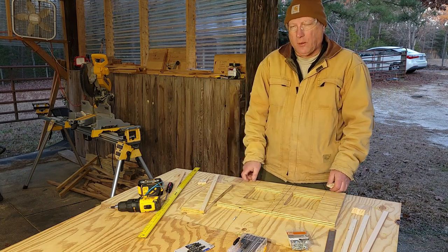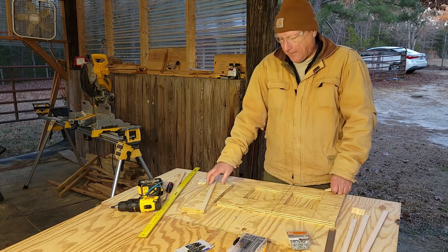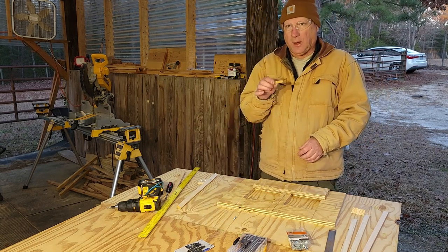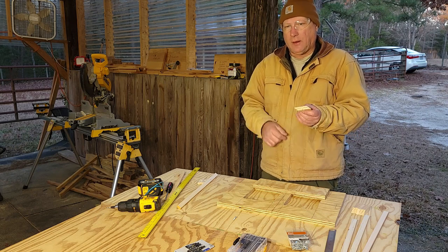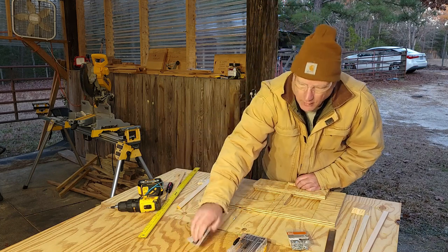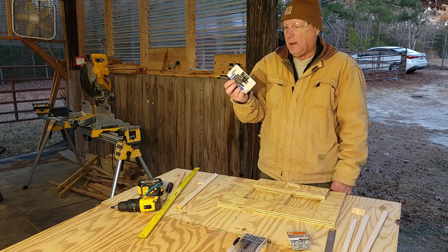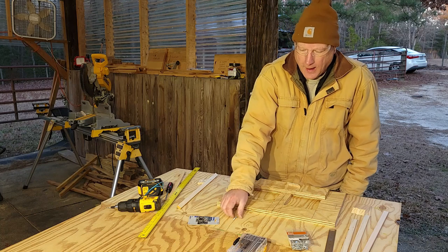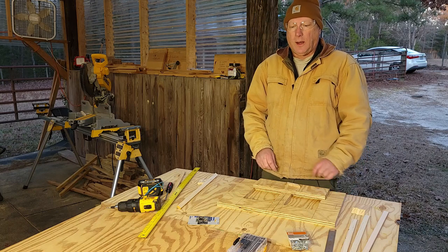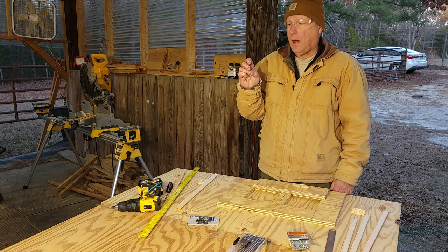I'm going to put the inboards on first. Remember, the front of the Snelgrove board is a solid piece, so that doesn't have a gate. So all I did, in my test run, was take my gate and mark the center lines of it. From there, I simply took it and used one of these countersink bits. In this case, I got it from Lowe's. It's Cobalt brand. It comes in a pack of four. They were fairly inexpensive. I can't remember how much they were. For this, because I'm using 3/4 inch wood as my base wood and then 3/8 inch rails, I ended up needing 1 inch number 8 screws.